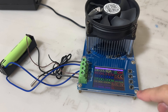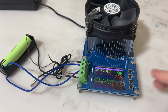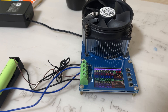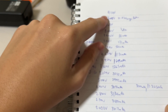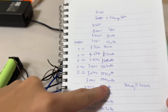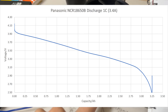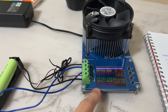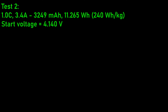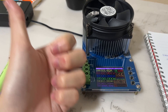Next: 4.14 volts, 1C discharge rate. As expected for the 3.4A capacity test, the capacity came out slightly lower — partly due to the lower starting voltage of 4.14 volts. It still delivered 3,249 mAh and 11.265 watt-hours of energy, which is still within less than 5% of the rated capacity. That is really amazing for this lithium-ion battery.